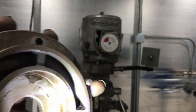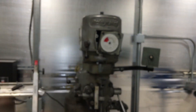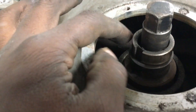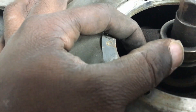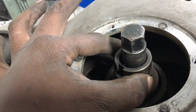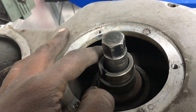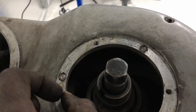This surface is scored a bit but for the most part even. If you look closely at where the drawbar is versus where this sleeve is, it's a little off-center — maybe about six millimeters. So this piece is not centered relative to here. The drawbar is running pretty much through the whole thing so that's where it's supposed to be, but this sleeve is cocked off to one side. This is where you press to remove that top piece.